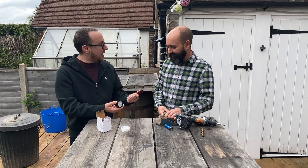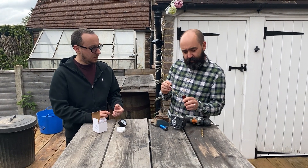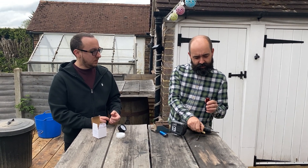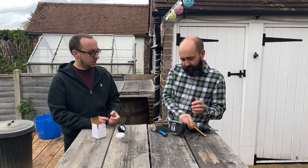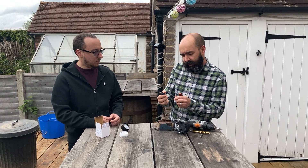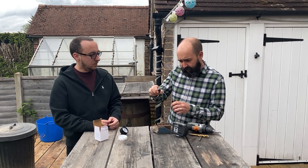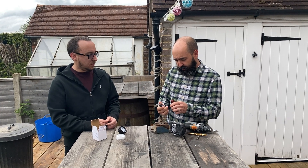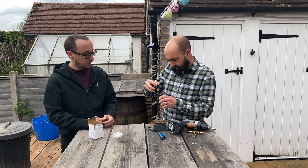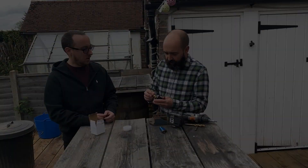So tell me what we're going to do today. So what we're going to do is I'm going to drill an 8mm hole first into the plasticky bit, and then I'm going to go up to a 10mm. And then we're going to warm it up with a camping lighter — you can actually hold it upside down and whatever else. And then as it's warm, we're going to tap the thread in and once it cools, we'll take it out.